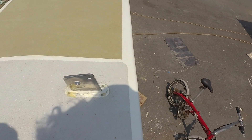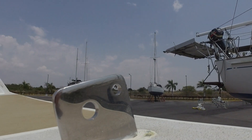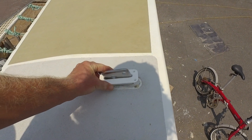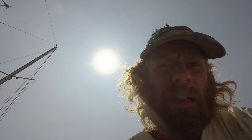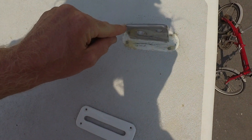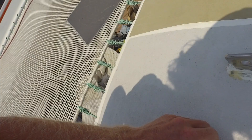You can see the chain plates installed here on the Amma — it's a bit rough looking because we haven't been careful, since this cover panel fits on top. I hadn't installed those yet mainly because I didn't have a drill long enough and didn't drill the holes before installing the chain plates. Now I received a longer drill — otherwise it was hitting the edges. All the chain plates will have these kind of covers on top to give more surface area for the sealant.